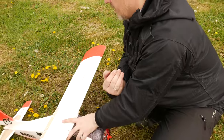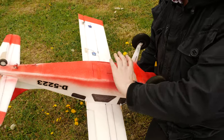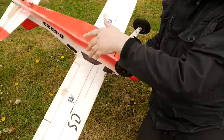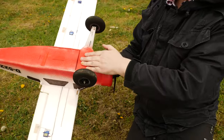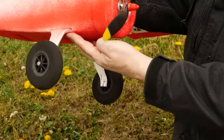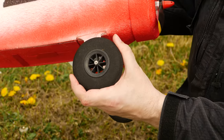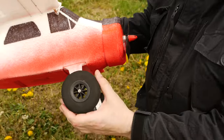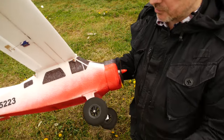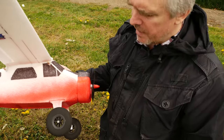Where is this weight? I make really many reinforcements inside. Plywood in the central and front part of fuselage. Many carbon reinforcements, actually everywhere. My custom landing gear, original is only steel wire. This landing gear is from carbon, fiberglass, steel, of course, etc. Huge tires, this is not original too. Huge tires, jungle tires or tundra tires, how you want. Original Beaver flies with tundra tires or bush plane tires too.